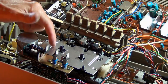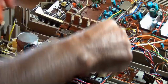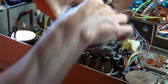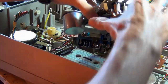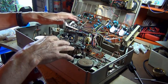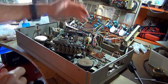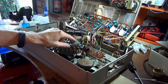There's a look at the tape deck — nice little cover plate over it. Pinch roller looks like it needs a fair bit of cleaning, and so does the head, and the record head. The real issue with this one is just cleaning up all the old grease in here — most of it has gone all hard. Spent about an hour and a half on this and used probably about 150 cotton buds. The grease had actually gone underneath the metal plates, so I had to put it up vertically and put a tissue underneath so all the grease came down. This is probably the worst I've ever seen on a tape mechanism.